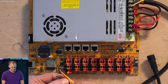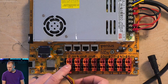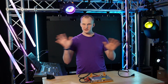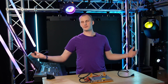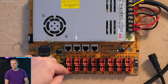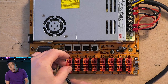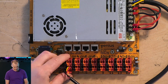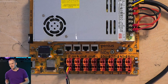Here I've got a standard three-wire pigtail: black for negative, orange for data, and red. You might ask why orange instead of yellow — this industry isn't big enough to invent its own electrical components, so they had to source an existing part; you can't create a new part cost-effectively for our industry. You flip down these little levers to open the terminal, press your wires in — strip them a little more than the factory strip on a pigtail — insert them, close the lever. That's it. It's solid, it's secure, and it'll light up pixels.